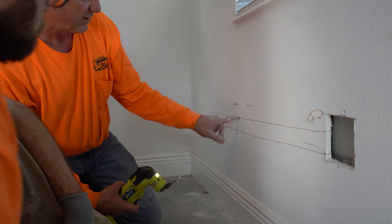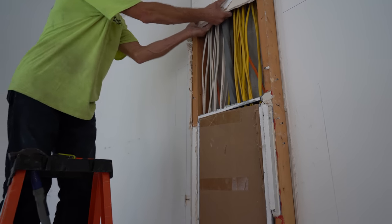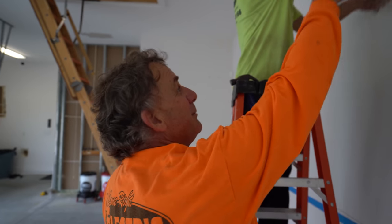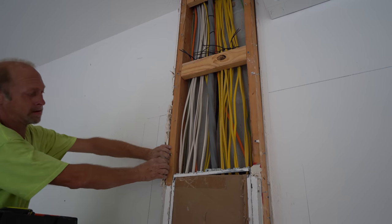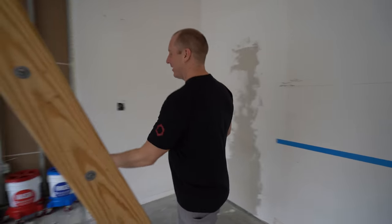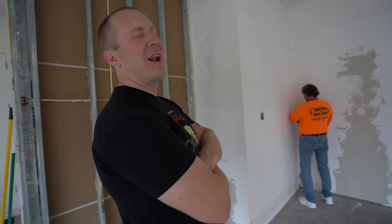We cut it all the way back and pull it out - just make sure not to get that blade in there and hit a wire. Now we have to take every one of these wires, move them over, and move them down the wall. The reason we moved them over is because these wires are coming from here, so if we move them over they'll be short enough to go into the outside panel without making any connections.